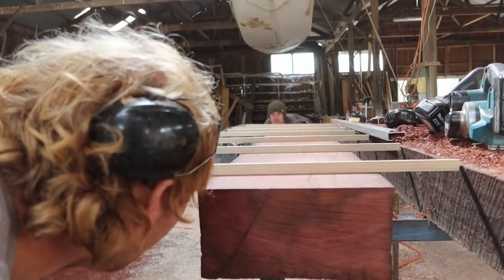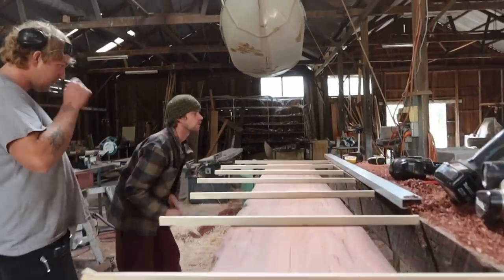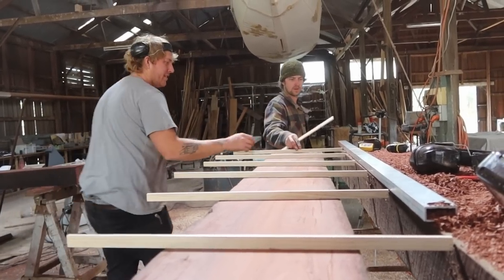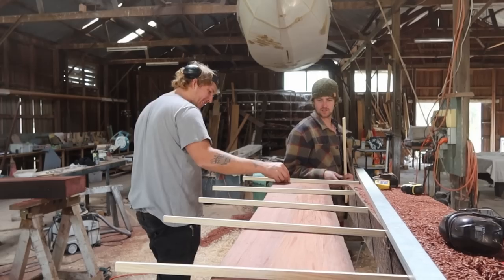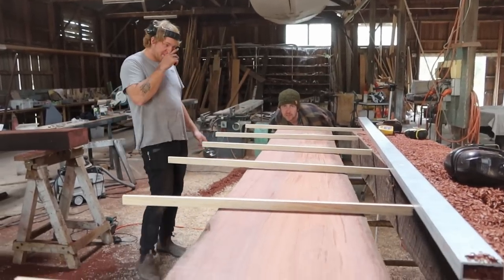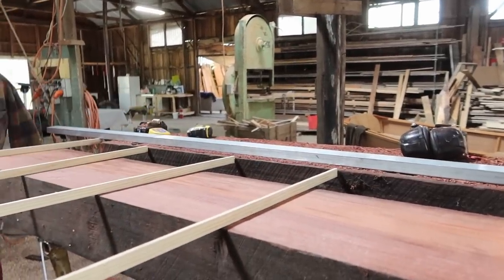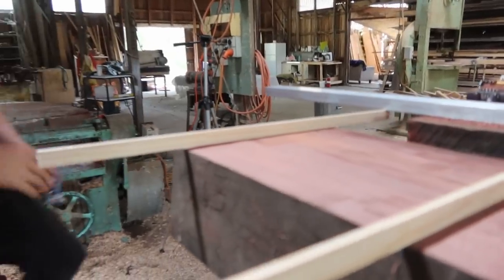You're just not sitting flat. I don't know if that sticks. This stick's actually bowed. So that's not sitting flat on there very well. No. Now it's on that straight. We'll just need to work the side. Yeah, I think you just got to take that hump out. And then the rest looks kind of okay. This one's just not sitting because there's a bit of a hump, but your thicknesser might take that out. Yeah, I reckon just work a bit on this end.